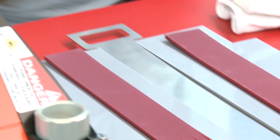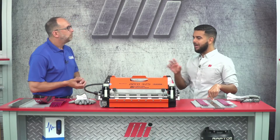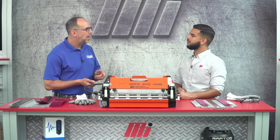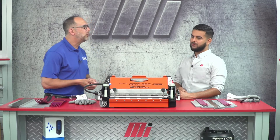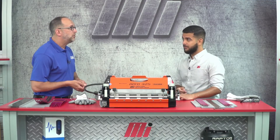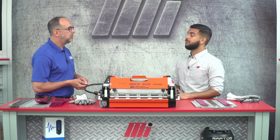So it sounds like you made the right decision with your belt choice, but what else do we need to do? It's important to have the right tools on hand, and we have that right here with the Novatool Aero 325 splice press and the narrow belt templates. The Aero 325 is lightweight and portable for producing consistent high quality splices. The newest member of the Aero family is just the right size for narrow belts used in live roller drive systems, and the narrow belt templates fit these applications perfectly. With splice times as low as 18 minutes, the Aero 325 can repair a live roller belt in a third of the time of traditional splice presses.